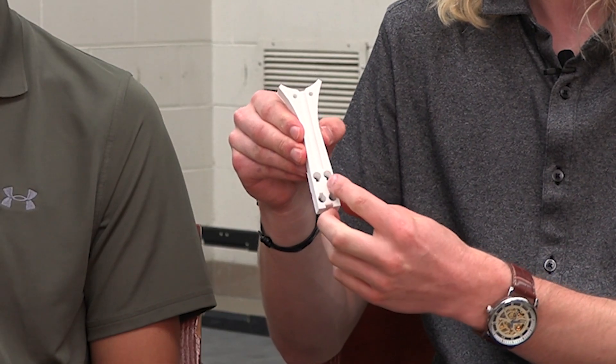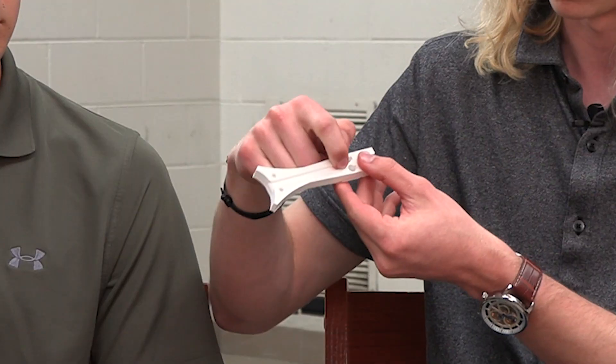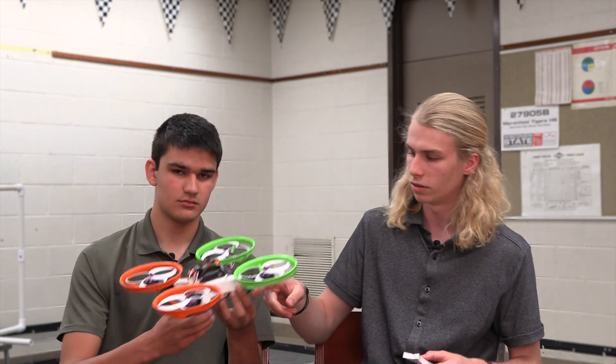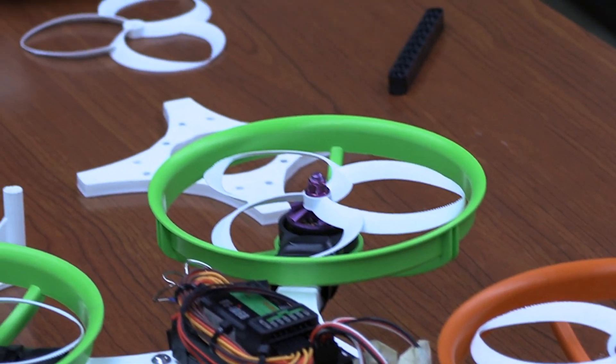You can see here they have the holes for the pop rivets, and then we have a cable slot here for cable management so the cable fits perfectly in there and then feeds into the drone body. The way they lock in is this geometry fits perfectly in with the main frame so that it doesn't wiggle around at all.